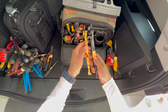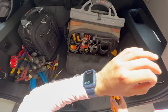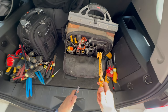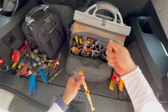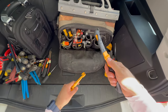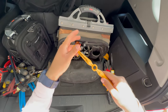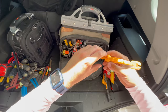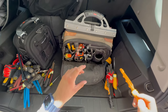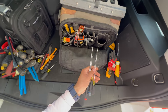This is an underrated tool called a Volt Claw. You can buy just one or as a set. Whenever you're doing service work or new construction and going back to a hot box — maybe just pulling wires or quickly inspecting something — you can use these hooks to pull on hot wires without using metal pliers that could nick them and cause an arc flash. They're non-conductive. You can hook a wire to pull it out of a box, turn it, put wire nuts on and tighten them, or push things into a box to fill the corners — such a handy tool.